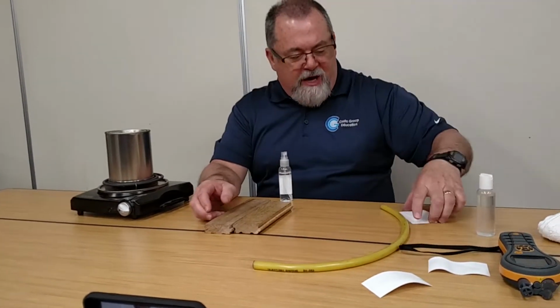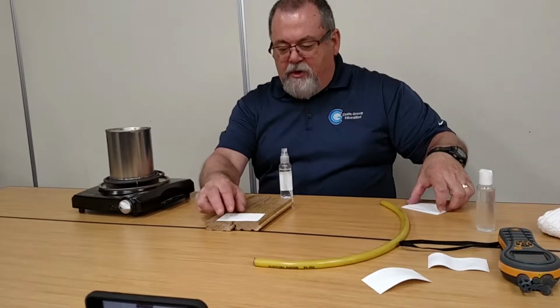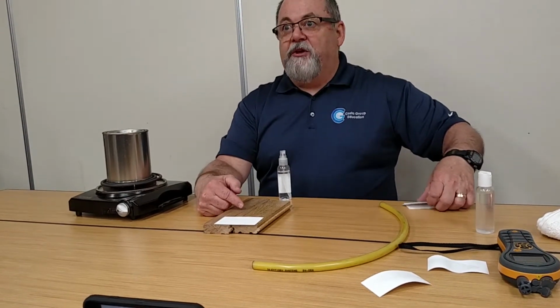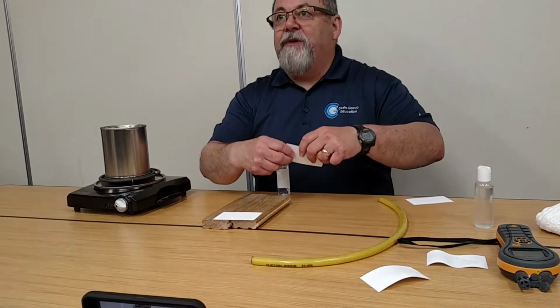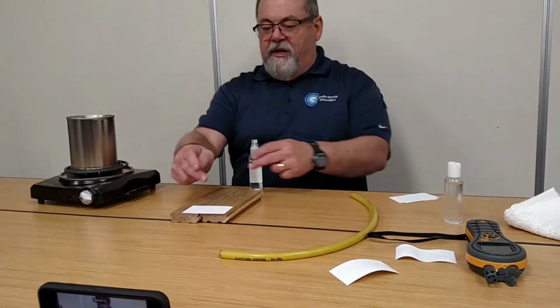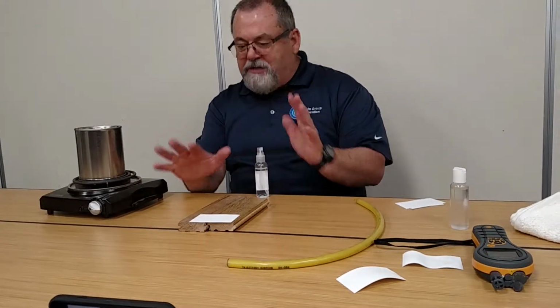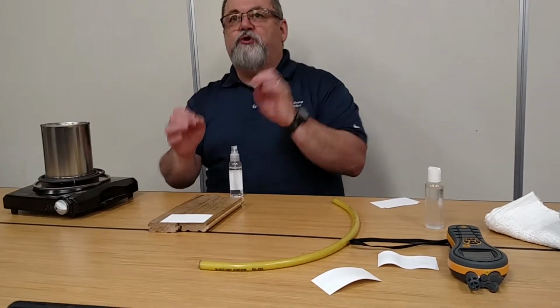So if we put our vacuum panels on the top and we use super dry heated air on the top, we're over drying the top. We're putting the wood under even greater stress, and we could be the ones putting in cracks, stress cracks, honeycombing, case hardening. There's lots of damage we can do to wood if we're too aggressive too early. But typically we're that way because we feel under stress that we gotta hurry up.